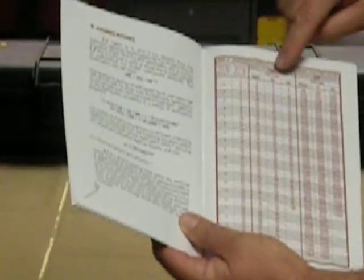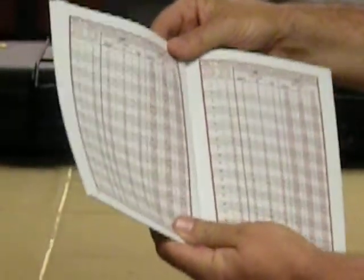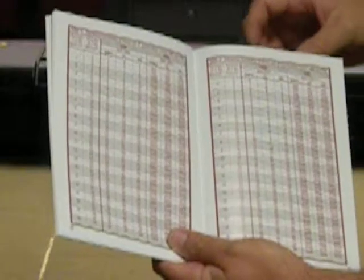The second part goes through the same thing without a vertical scale, where you either measure between the two-inch marks that are on the drive rod, or you mark your drive rod and measure how many blows it takes to go between your marks. It also discusses not using the hammer beyond refusal. There are correlation tables showing the hammer with the 17.6 pounds and the hammer with the 10.1 pounds, where the multiplication of the index is not required — you can go straight across with the number of blows to get your CBR based on soil type: CL, CH, or other, and the same for bearing strengths in pounds per square foot.